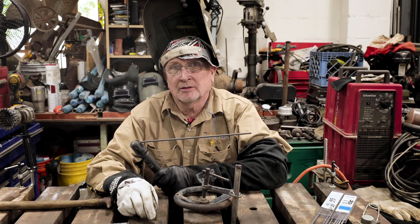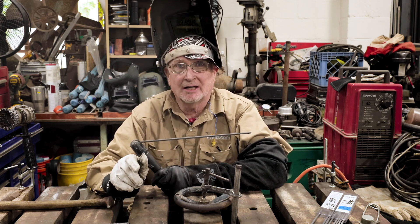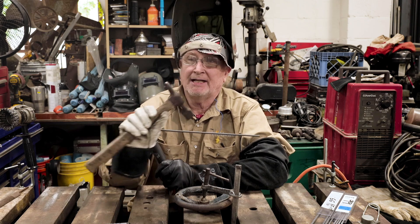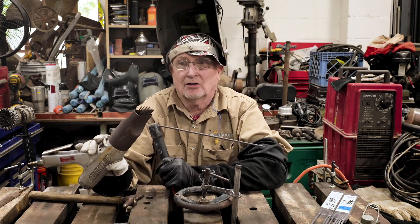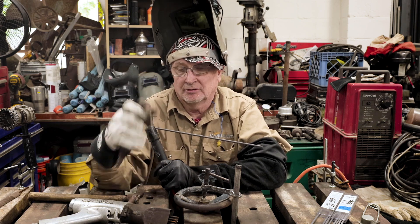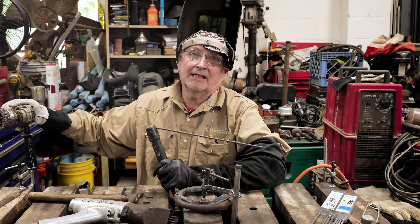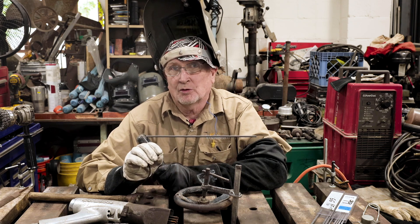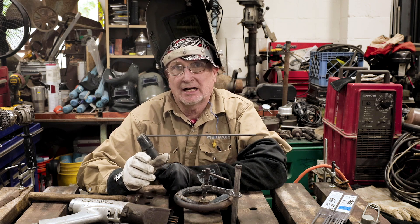What's real important is that while I'm doing this weld, I'm only doing a short weld — it shouldn't really be more than 10 times the diameter of the rod. With a 1/8-inch rod, that's about 1-1/4 inches, no more than that. As soon as I stop welding, I want to peen it over with this chipping hammer that I've rounded the edge off. I can also use a needle scaler or a power wire brush — both of these peen the weld as it wire brushes. By peening it, we're expanding the metal as it's trying to shrink so it doesn't put extra stresses on the cast iron or the weld bead itself.